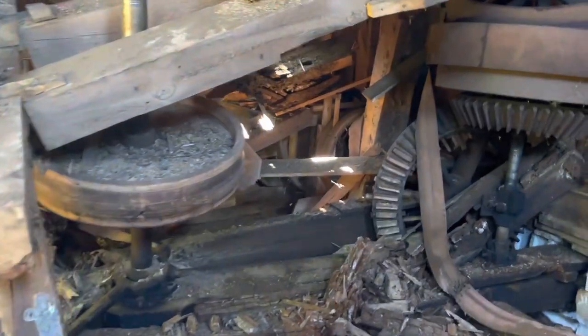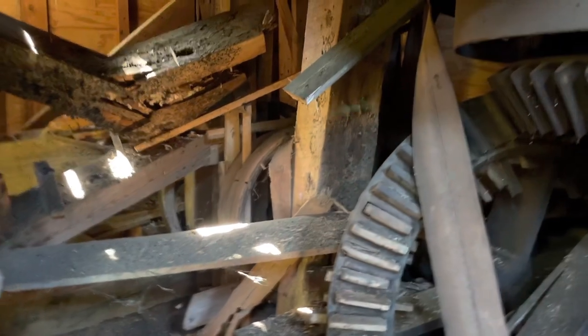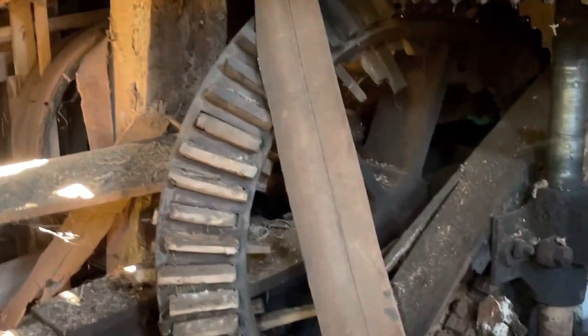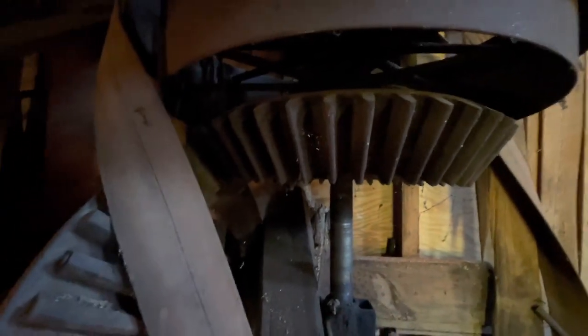The main gear train on this mill: the main shaft from the water wheel comes right through here and runs these back pulleys. Right here you've got a mortise wheel — a wooden tooth mortise wheel — that meshes with a cast iron bevel gear to change the direction of the shaft from horizontal to vertical.